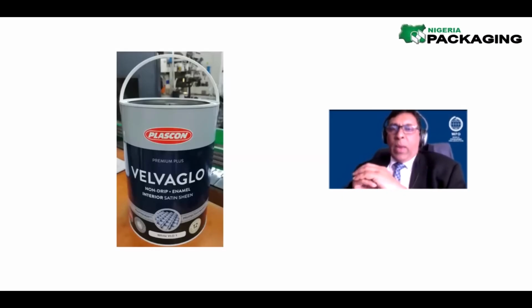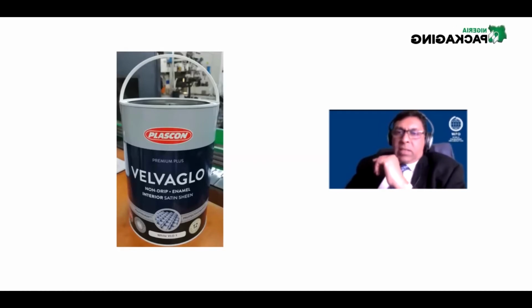Ultimately, we are working with steel, and when steel is subjected to water, water vapor, humidity, relative humidity in the air, there is no doubt about it, it will start oxidizing. Rust is another word for oxidizing. Oxidation is when the atmospheric oxygen eats into the tin plate. This also can come from water, because water is made up of oxygen and two hydrogens, or H2O. So this will eat into the can.